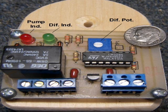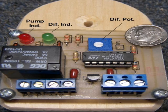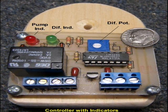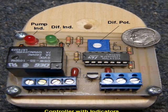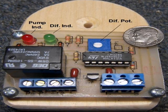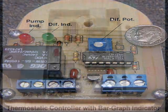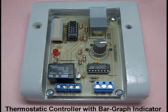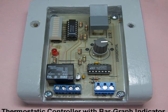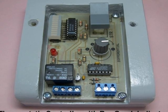The red indicator lamp comes on when the relay connects power to the pump. There are a variety of differential controllers available, with a variety of features and prices. The controller I'll be demonstrating in this video uses a red LED to signal that the pump is on and a green LED to indicate the differential temperature. Another controller also uses a red LED for pump-on status but uses a bar graph to approximate both collector and storage temperatures.